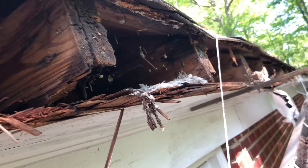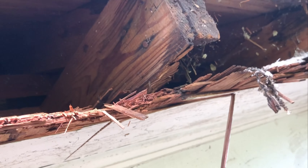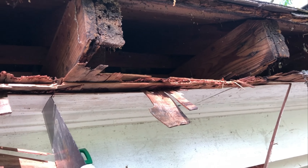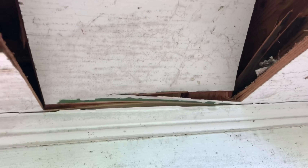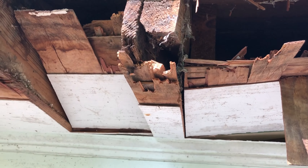In order to get the soffits out I found it necessary to cut with a regular hand saw at specific locations - you can see where I've got the hand saw here. I'm cutting between the roof trusses to be able to knock them out. After making those cuts in the soffit on either side of the roof truss, I'm banging up on that cut area with a sledgehammer to knock those pieces up, slowly taking this out chunk by chunk.